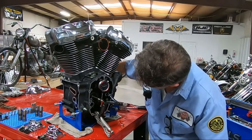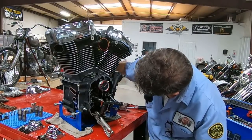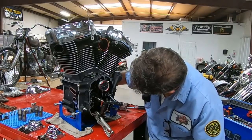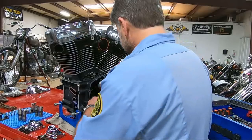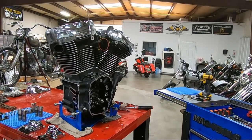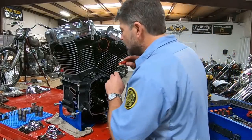We're on zero. We've only got three and a half thousandths runout on the crank on this side. I'm not going to worry about checking the other side yet. Cam bearing looks good. Still a mystery. We've still got a ton of metal inside the oil ports on both the front and rear galleys in here.